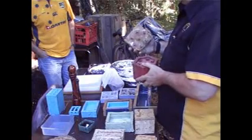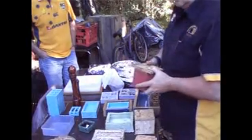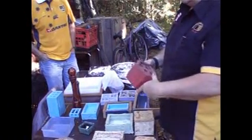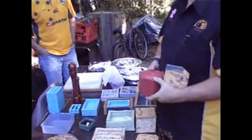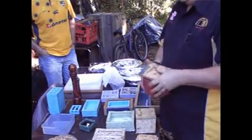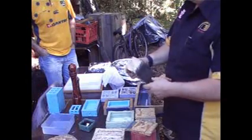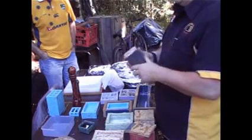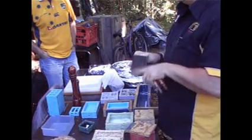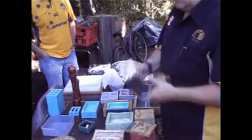Again, a holder over the top to keep the products down, and I will be using this one today to show you how it works. This one's harder to get the blanks out of when they're cast because it is so solid, but you just basically push very firmly to get them out. This one here is quite flexible, much more flexible than this rubber, but as you can see I got a bit over enthusiastic pushing the blanks out and my thumb went straight through it. So I've recast that with a bit more silicone over the top. But I just used a black tube of silicone I had handy.